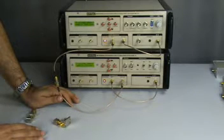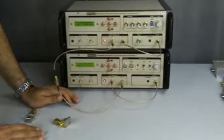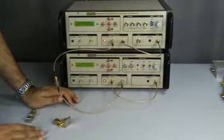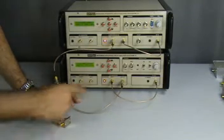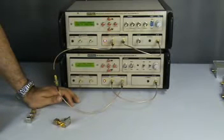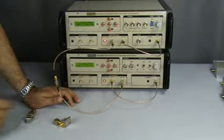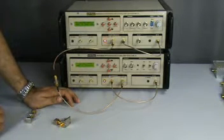We are trying to explain the S-parameter measurements in the microwave circuit analyzer MIC10. We are generating a signal of 0 dBm and we have connected two 20 dB attenuators in the signal path. We have taken the measurements at 1500 MHz in the receiver. The receiver right now is displaying a power level of about minus 40.5 dBm.